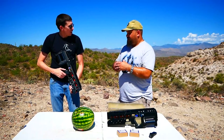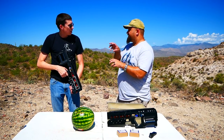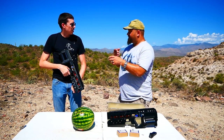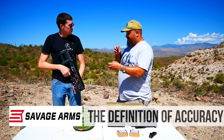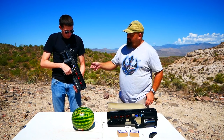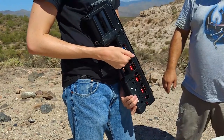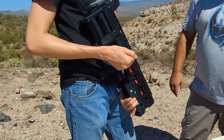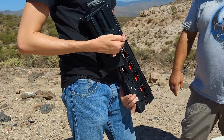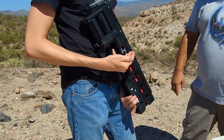So you pass an electric current through the coil, it turns into an electromagnet, it sucks the projectile towards it, and the momentum carries it down the barrel until it reaches the next coil, which pulls it again and again until it goes faster. How does it know when to fire each coil? This is timed with optical gates. At the entrance to every coil there is an infrared beam and an infrared detector on the other side. When the projectile enters the coil, it blocks that path, and as soon as the sensor stops detecting infrared light, that triggers the electrical impulse.